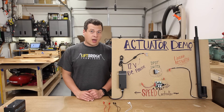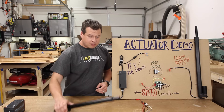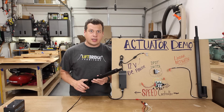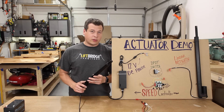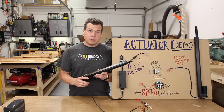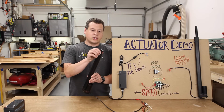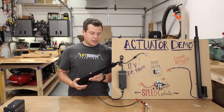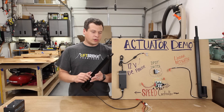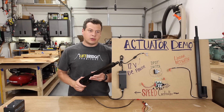These things are really powerful and you can operate them on a little rocker switch. A lot of people when they see these things think they have hydraulics, but these aren't hydraulics. Hydraulics move with fluid whereas these are electric. Basically what you have is a 12-volt DC motor which internally turns a big screw. When the motor turns the screw, the screw pushes and pulls on this rod. They make these in various different lengths and capacities — this particular model is a 12-inch stroke version, so the rod will extend out 12 inches, with a max capacity of 225 pounds.